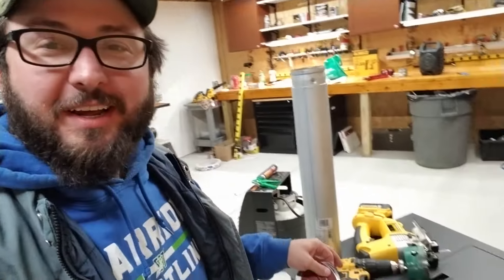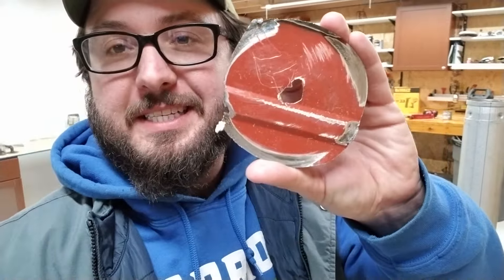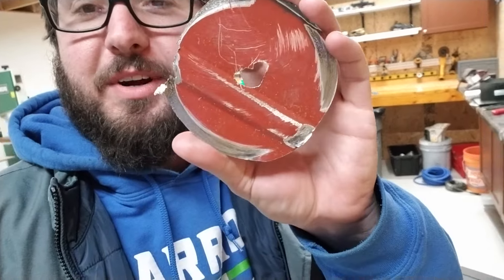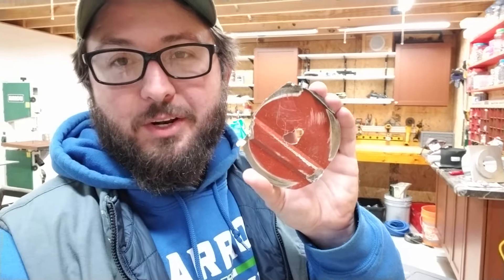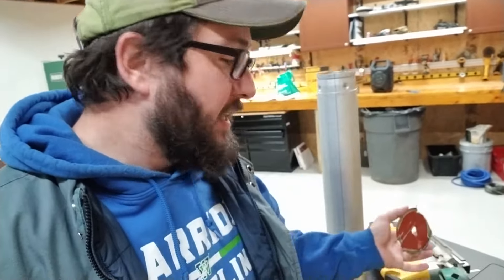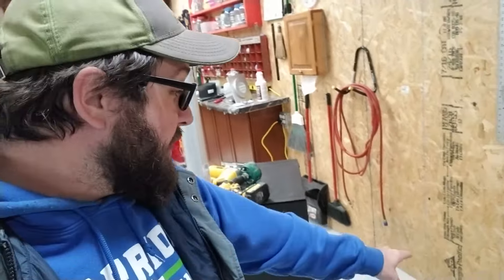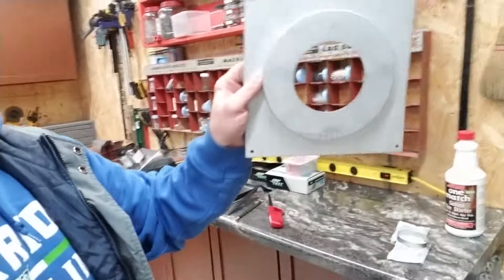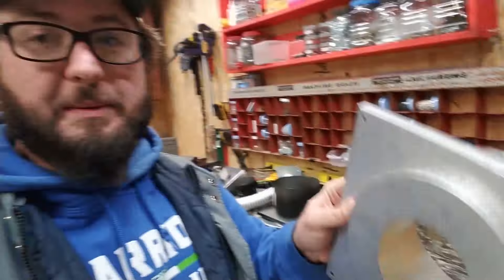You may have noticed a tool change there halfway through — went from the hole saw to the jig saw. When you're using a hole saw, make sure that pilot bit is tight inside the hole saw. My bit was loose, it danced around and created a goofy pilot hole, and then the hole saw was dancing all over the place. So I had to switch over to the jig saw. Got a pretty decent hole cut — I'm happy with it. I don't have a jig saw or hole saw that size, so I had to use the jig saw in there for where this is going to sleeve through the wall, and then the stove pipe sits in the middle of it.